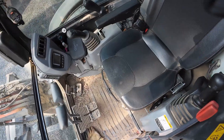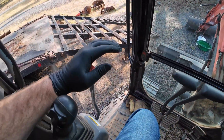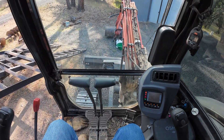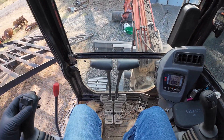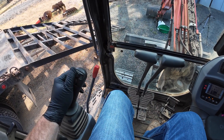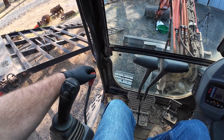Okay, first thing that you do: climb in the cab, put your lock arm down, turn your key on, arm your auxiliary, and then come over here and work your control. That will bleed the pressure off of your line. Very important you do that.